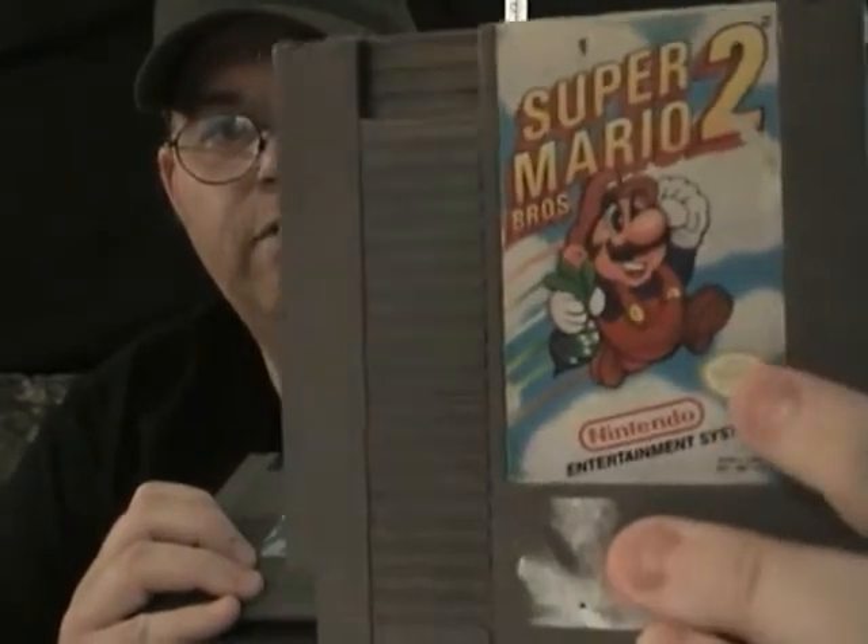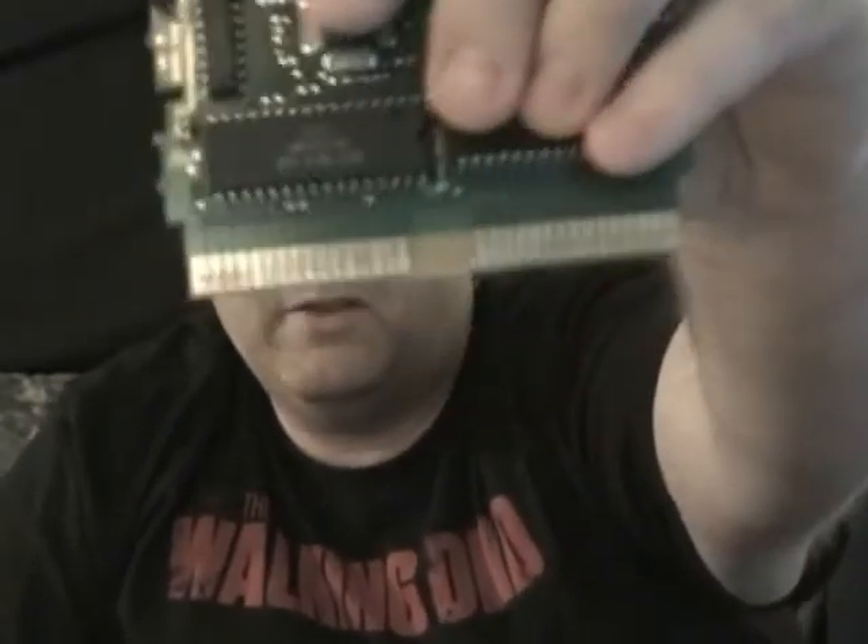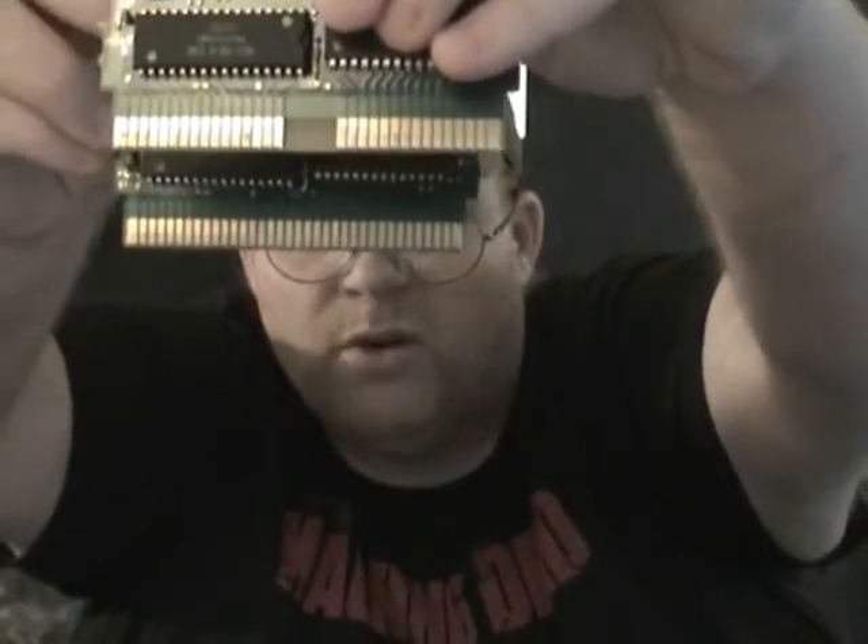Let's go back to what people usually have to do. You have Super Mario Bros. 2, okay? Now there's a difference in these boards. In this one, you see right under his foot, he's got the little symbol. There's the same type of board in here, but one has all the pins across and one doesn't. The one that does is the one you need — which is the one without the little symbol. That's the one you need to make a Final Fantasy III. You can see how all the pins go all the way across. The other board, the traditional one that you'll find, is more common — you can see how the pins are separated.